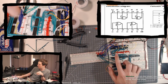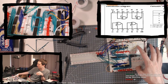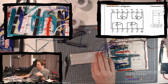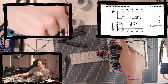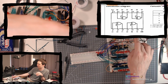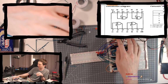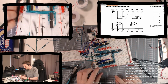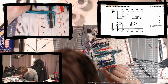What are the LEDs for? So these ones are the current content of the registers. These two are register modules, so this is what is currently stored in those registers. These ones are simulating the shared bus right now, what is on the bus. And these LEDs up here are just status LEDs for the clock module. This clear LED here is blue and that's the actual clock output. And these three are internal things from the clock module. If one of these cables underneath is not properly in, I would never be able to tell that.